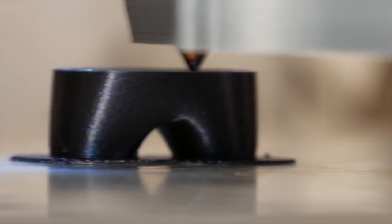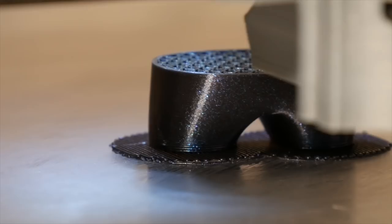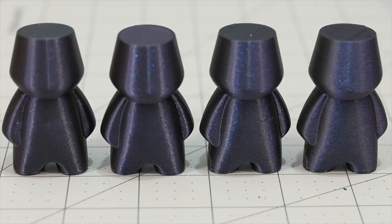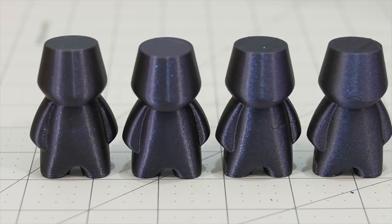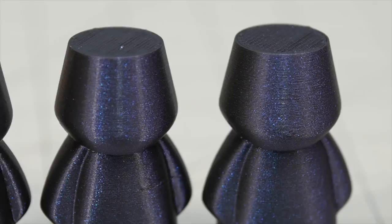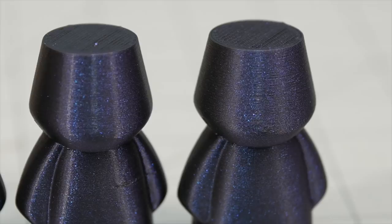So I figured I'd test out layer height differences and what effect they would bring out on the model. Since I wasn't going to reprint Voodoo Brie for each layer height, I opted for Filamentum's new mascot, Filafella, designed by the awesome Flowalistic — it's clean, easy to print, and doesn't waste too much filament. I printed four versions: one at 0.10mm layer height, one at 0.15, one at 0.20, and one at 0.25. I could clearly see that the thicker the layers, the more prominent the glitters were, and therefore the blue became even more prominent, giving it a much deeper color — looking more like the filament on the spool rather than the purpler hue once printed at finer layers.